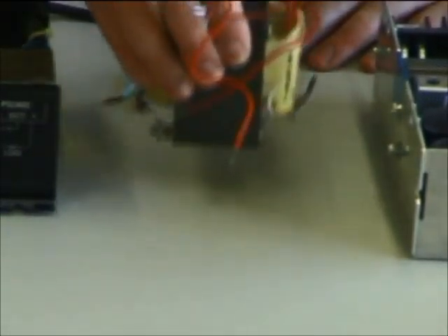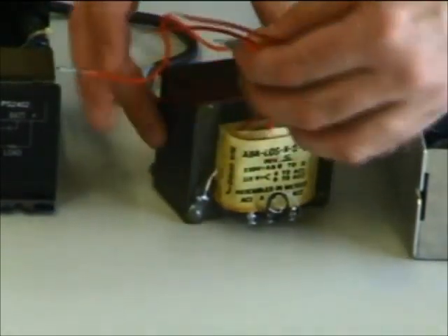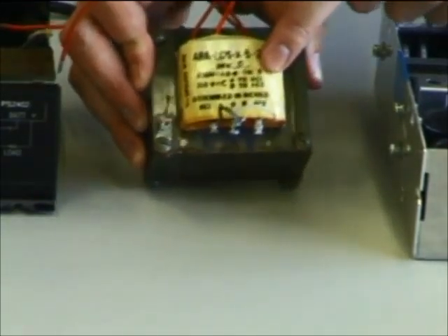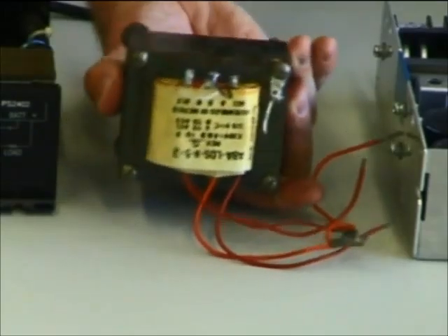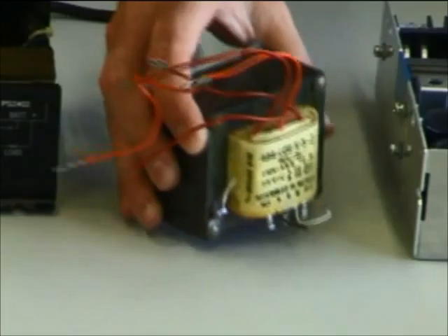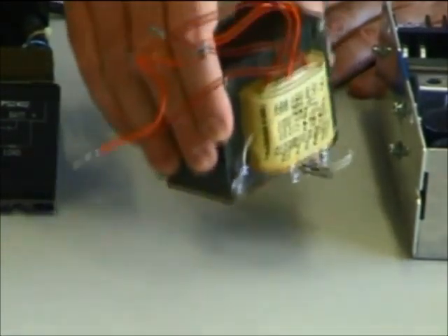You can get smaller ones running off the mains, and other transformers for carrying audio signals from one voltage level to another. That's a smaller transformer, probably about a 15–20 watt rating. You can just see the copper-coloured windings inside — they look like bare copper but they've got a varnish-type coating over them to insulate them from adjacent turns. Here's a larger, huskier one — about 50 to 100 watt rating. It's designed to run on 230 or 115 volts; it came out of a piece of laboratory equipment. It's quite big enough to run a typical VHF transceiver, or you might use two in a supply for a HF one, or one about twice that size for supplying 20-amp current levels.